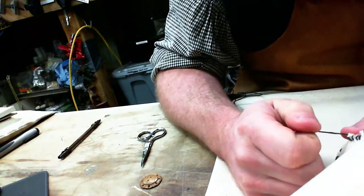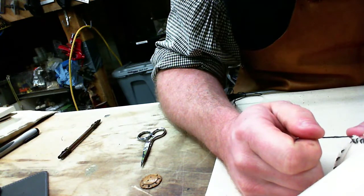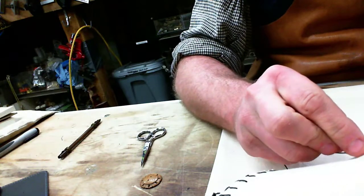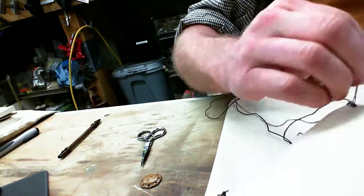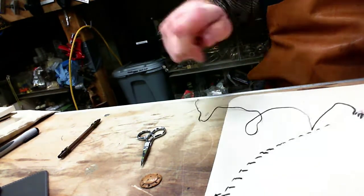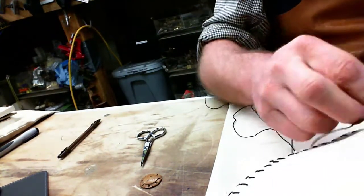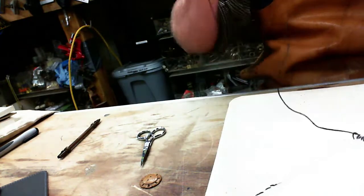No tongue buckles. No center post. Okay, cool. Yeah, just ring buckles. Nice. Beat them down to an oblong shape. Permanently attached to the strap on the flap. To buckle, the bottom strap comes up, from the bottom, through both, over the top, and back through the lower ring. Yeah, that is a super early buckle design. Bronze Age tech there. Love it. Roman buckles are often like that too, so that you have just the simpler shape, no moving parts, using two rings to make a buckle. You see that in a lot of horse tack still too. Usually the tongues on a buckle are made of iron, and they can tend to be fragile and break as opposed to non-ferrous metal. So if you can get away without moving parts, do it.